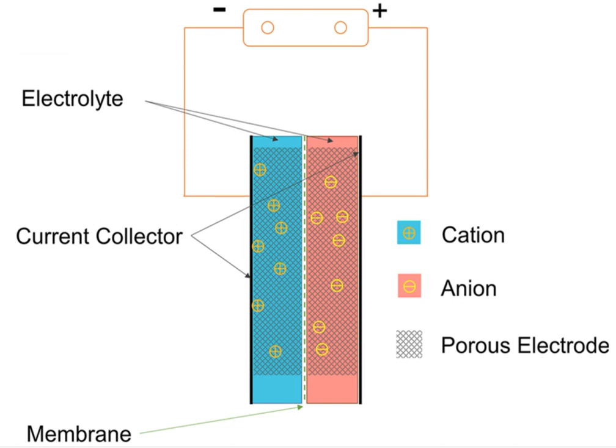Unlike ordinary capacitors, supercapacitors do not use the conventional solid dielectric, but rather they use electrostatic double-layer capacitance and electrochemical pseudocapacitance, both of which contribute to the total capacitance of the capacitor, with a few differences. Electrostatic double-layer capacitors (EDLCs) use carbon electrodes or derivatives with much higher electrostatic double-layer capacitance than electrochemical pseudocapacitance, achieving separation of charge in a Helmholtz double layer at the interface between the surface of a conductive electrode and an electrolyte.